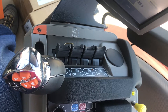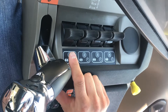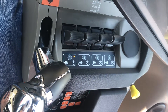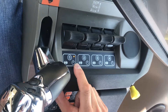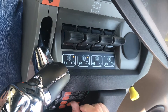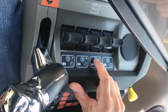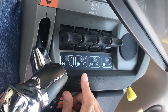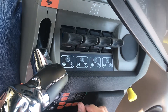Just another way to set your timers. When running timers on a Magnum tractor, you can tell the timer is activated by pressing the number 1 button for your number 1 remote. When the orange light comes on on the right-hand side, that timer is active. Same thing for number 2, 3, and so forth. To deactivate the timer, all you have to do is press the number 3 button again and the orange light goes off, just as well as if you go to number 2 or number 1.